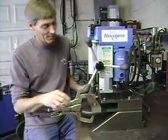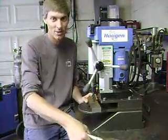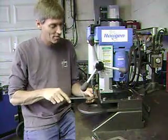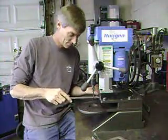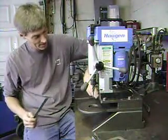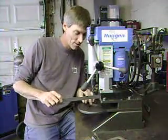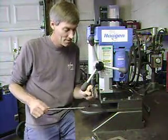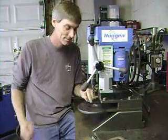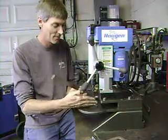When you set up the machine for your magnetic drill, there are a couple things you need to know. How far this distance is — mine is an inch and three-eighths. This magnet must be flush with the front of the table, and then the center line of the hole must be one and three-eighths inches out from that point. The hole also needs to be centered this way.